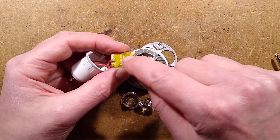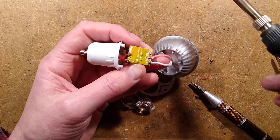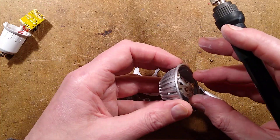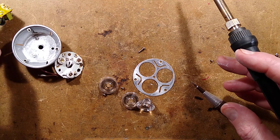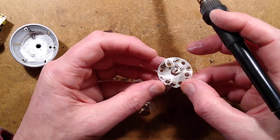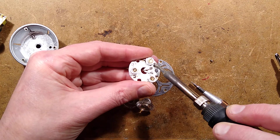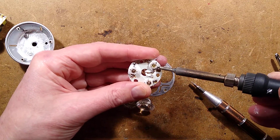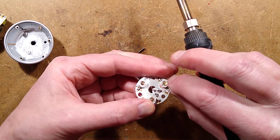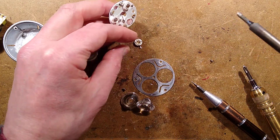Right, I'm going to de-solder — the soldering iron's on, let's do that right now. The other wire is next to the capacitor — I'll remember that. I'll take that off so I can get the circuit board out. It smells slightly of hot electronics. The red LEDs look dark but they're fine. Here's the rogue blue LED — let's see if I can get that off by heating up this pad and then lifting it. Of course this is an aluminium-core heat sink PCB, so not so great for getting LEDs off. There's a little dab of heat sink compound underneath.